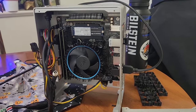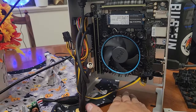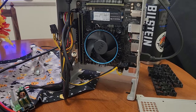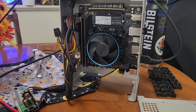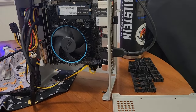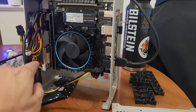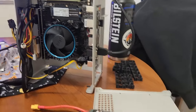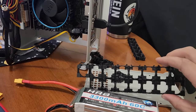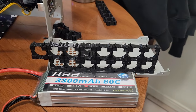And just to test it right now, before I get my battery pack built, I'm gonna build a battery bank right here that is basically out of the same battery cells that everything uses nowadays, like 18650s. I think the ones I got were 21700s or something like that, but they should be here this week sometime soon. And then I will basically build a battery bank at the bottom of this here that is going to feed this power supply. And right here I have some things I 3D printed to hold the batteries, but basically it's gonna be 8 cells long by 2 cells high.